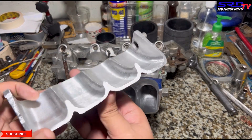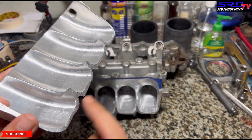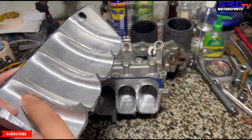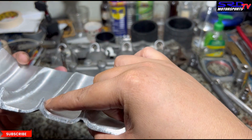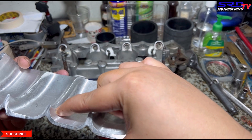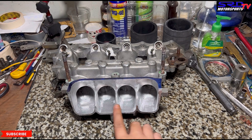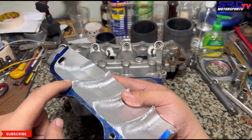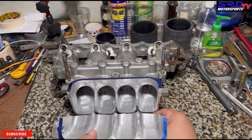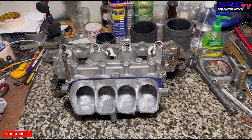As I mentioned, we were not going to have the underside welded — look how thick it is. What we're going to do is line up the marker on the divider and carve it down just enough to be thin before it breaks through. We'll round off the leading edges like here on the manifold so flow is guided well throughout and doesn't cause unwanted turbulence or shearing effect.